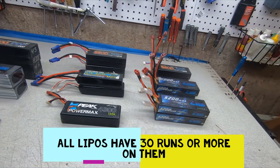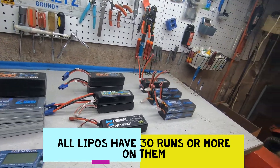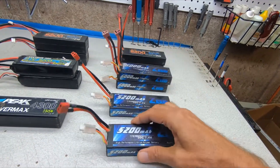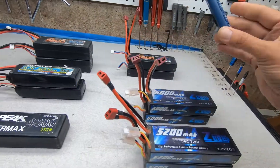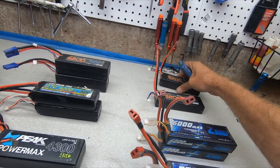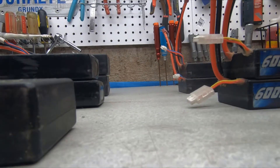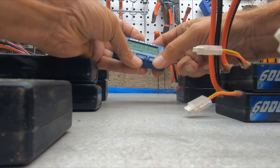What we're doing now is just a recap on lipos that I own and how they're holding out. These 2S's are fine - Z batteries, not puffed, they've got a good number of runs on them. I checked these out on the little lipo tester and I think one of these had a variance between the highest and lowest cell of 0.033 - that was the highest I found.